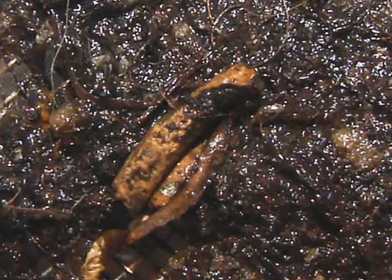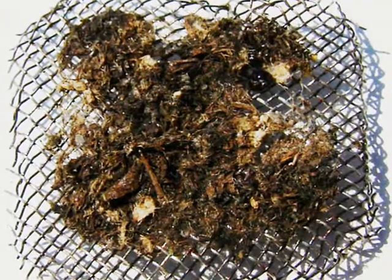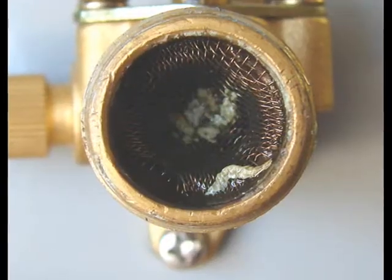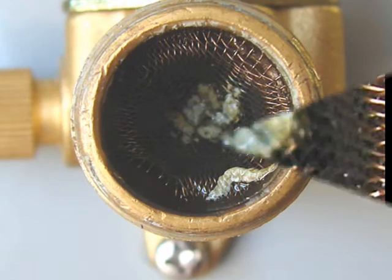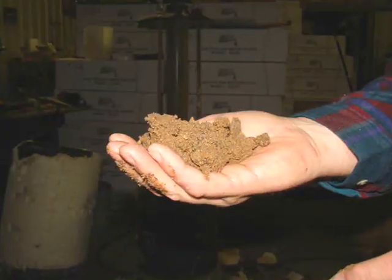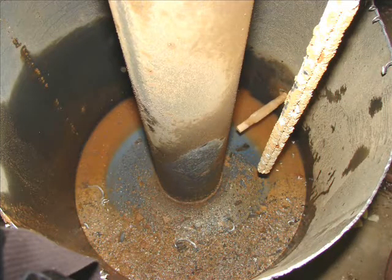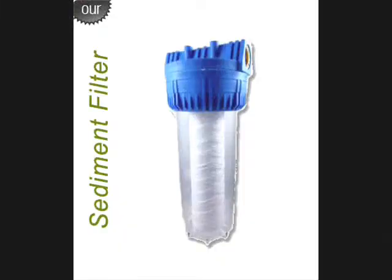Notice in the image there is hair and other unknown debris. In another image, the contamination is actually pipe thread sealant, which accumulated in the screen, obstructed the heater, and caused it to malfunction. Regardless of the manufacturer, tankless heaters do not have the capacity to accept accumulations of debris. It is necessary to filter and/or soften the water.